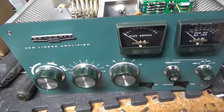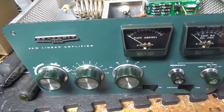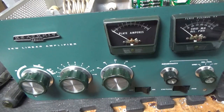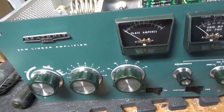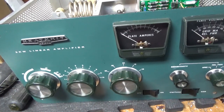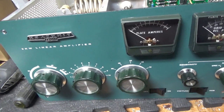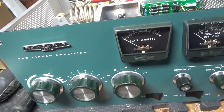He told me he would use it and in idle he'd go from CW-tune to SSB and he would hear a ding, ding. So most likely one of the tubes is arcing. When I test them, it's with the filament cold, so the structure can move a little bit — the grid structure also. So they're probably at an even lower breakdown voltage rating at that point.